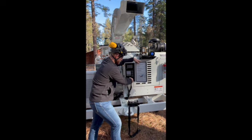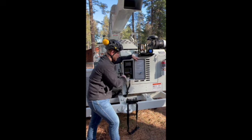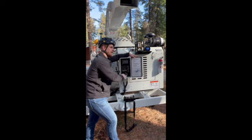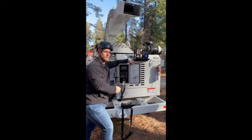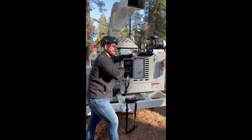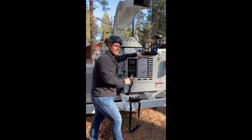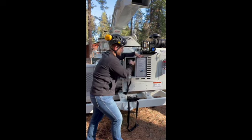Go ahead, I'll shut that down. Now this is one of the key factors, guys, on these Tier 4 Final systems. Anytime we shut this key down, we need to allow 15 to 20 seconds for a complete shutdown before we restart that cycle up. In that 15 to 20 seconds, you have DEF fluid in that DEF tank that's sending to the engine. In those 15 to 20 seconds, you could hear it right now, that humming, it's sending that fluid back into the tank so it doesn't sit in that line and crystallize and ruin those DEF lines. So wait 15 to 20 seconds.